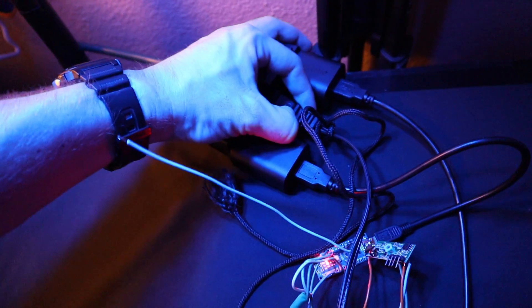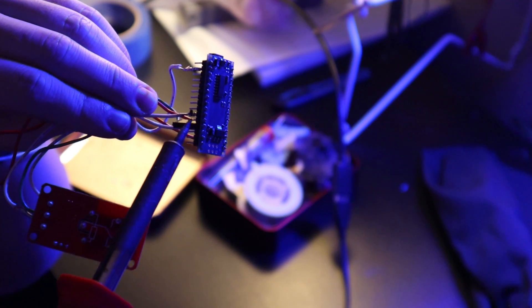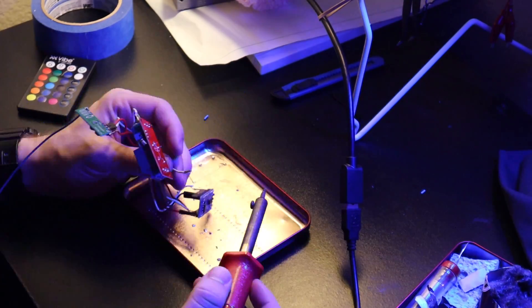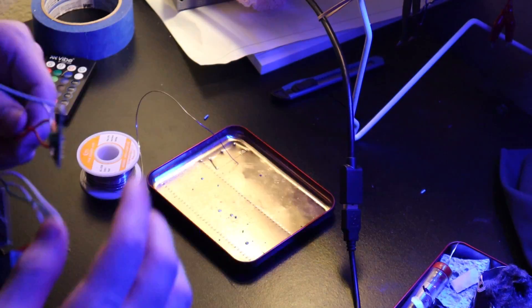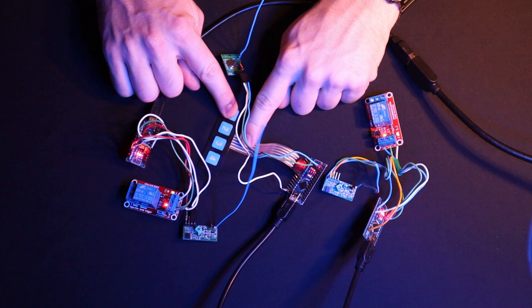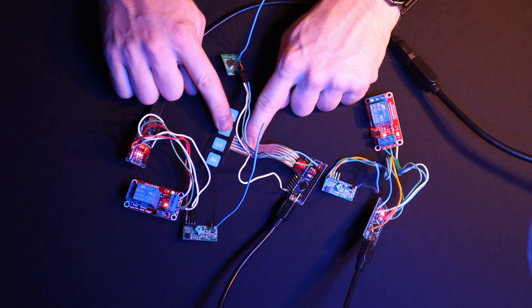So what's supposed to happen is I press the number one button, one of the relays is supposed to go off; I press another button, the second relay is supposed to go off. But I was so tired last night that when I soldered this together, I ended up soldering both of the receiver pins onto the same pin — digital pin three. So now I need to unsolder it and refilm this part. I've just got to move this pin and put it on digital pin two. Not too bad. Don't judge me on my soldering, but I got it done. It should work now. Press number one. Number two.